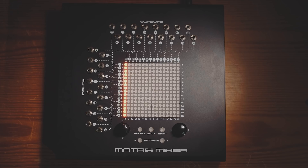It's connecting inputs 1 to 16 to output A. In this example, the LEDs are all fully lit, but I could go through and set different attenuations as I want. What this patch is representing when you are combining multiple inputs into just one output is a mixer circuit. But in this example we have a 16-channel mixer — I've never heard of a 16-channel mixer in Eurorack before.